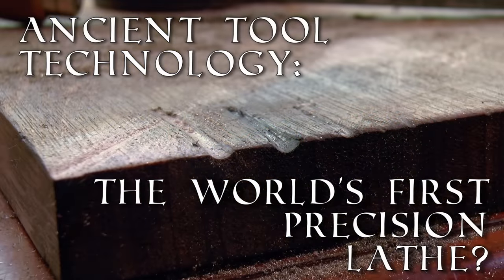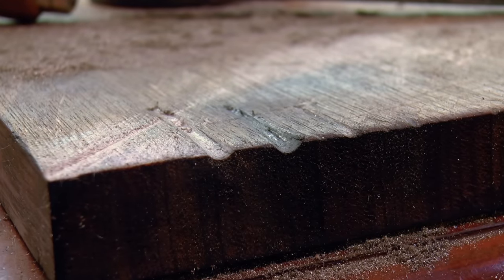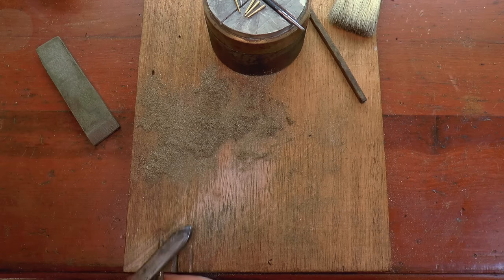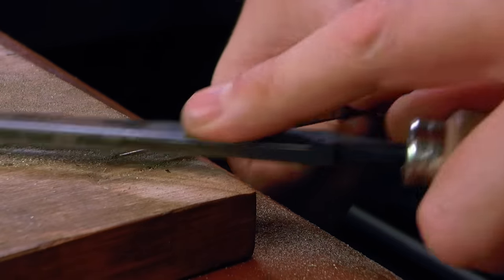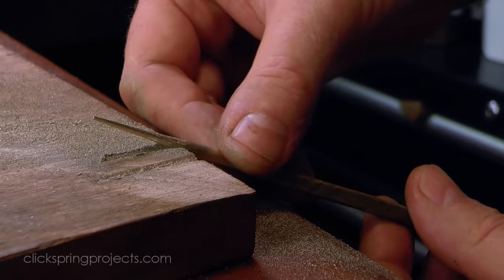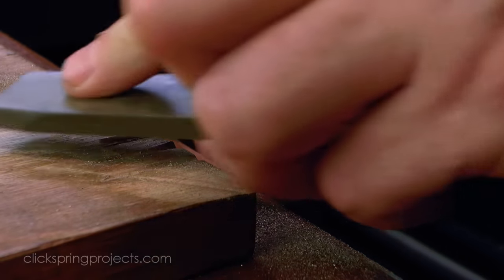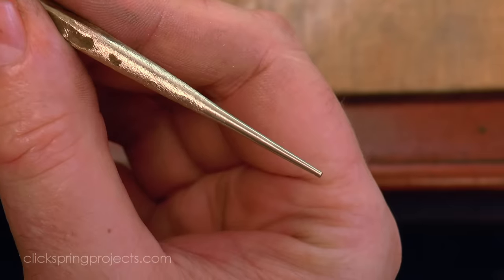There are many carefully made components within the Antikythera mechanism. The fastening pins, for example, need to be well formed to fit snugly within their respective holes. It's the sort of work that's most conveniently done by hand on something like a filing block. Quite precise results are possible with this simple approach, using a file, a notch in some wood, and maybe some abrasive stones.